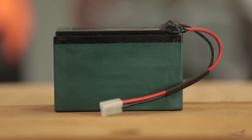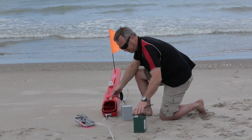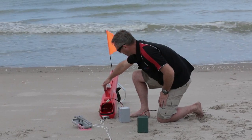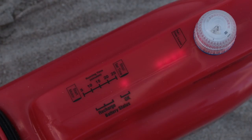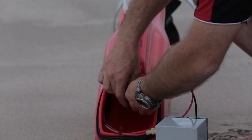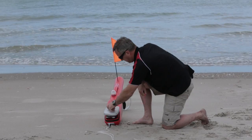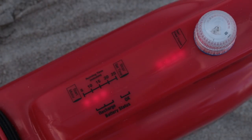The lithium batteries have iron in them and they can upset the compass, so we recommend keeping the lithium battery clear of the GPS seahorse when setting the course. The procedure is: set the GPS seahorse on the beach pointing in the correct direction. Place the sealed lead acid battery beside the Kontiki and plug in. When the two lights are showing, swipe the magnet over the set clear course to set the course. When the four lights are showing, get the lithium battery and insert it into the Kontiki and connect. Now lift the SLA battery and insert into the GPS seahorse and check the connection. Put the hatch on and you are now ready to go fishing. See the next section for setting the timer and starting the motor.